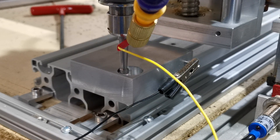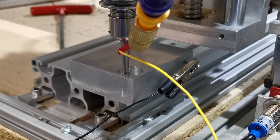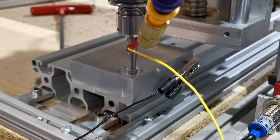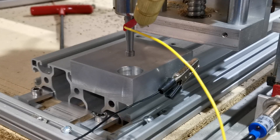We've gone reasonably close to the center. We don't need to know the diameter of the probe because we're finding the center, and as long as it's circular it should be no problem at all. That's the end of it — we'll just save that and now you actually know where you are for the edge finder.